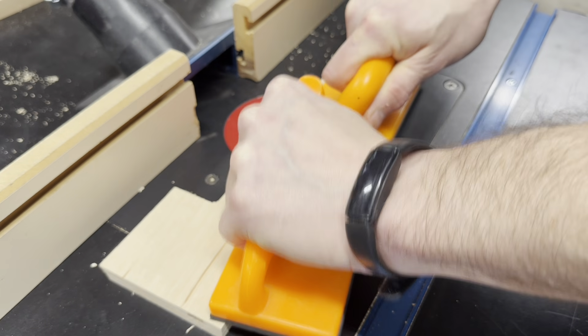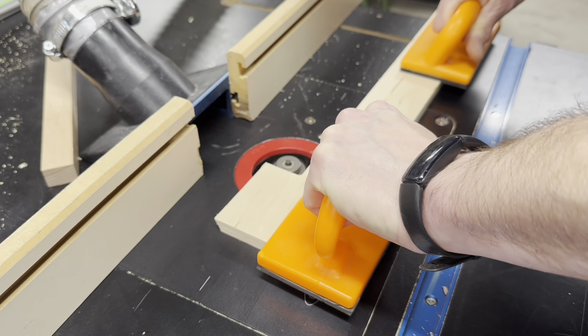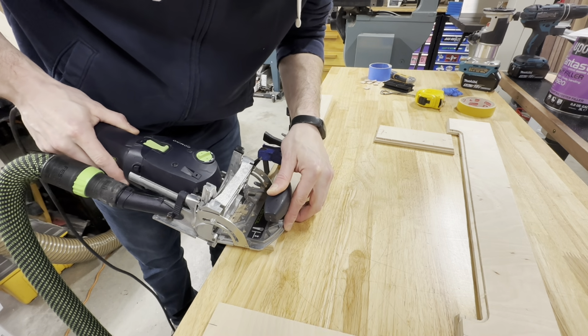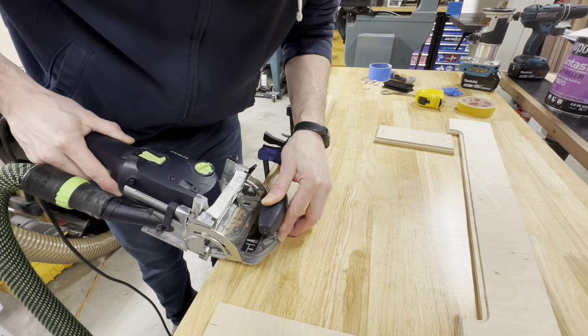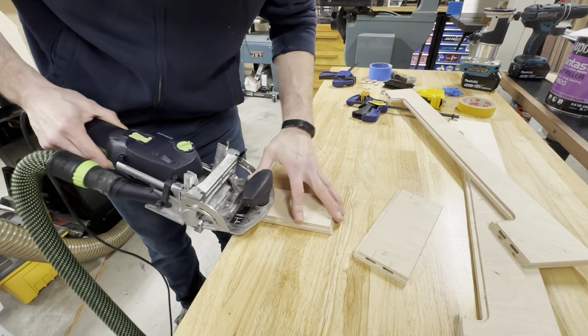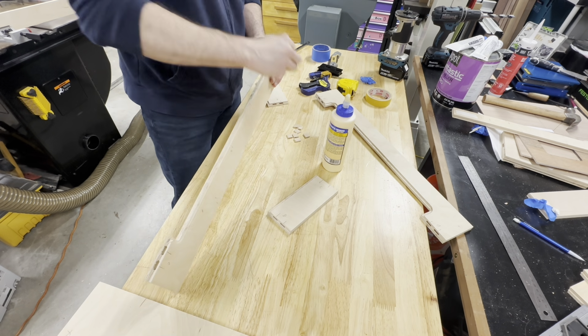Just the same as the top part of the lid, after I removed the excess with a flush cut bit, I used the router to cut a little rabbet to hold my plexiglass panel that I still had to make. I used the smallest size dominoes to be able to secure that 22.5 degree angle that helps make up the shape of this lid, and doing that with 1/2 inch plywood is tricky at best.